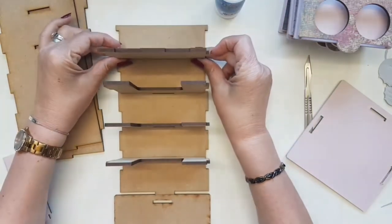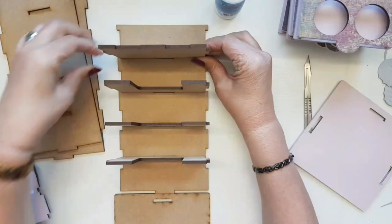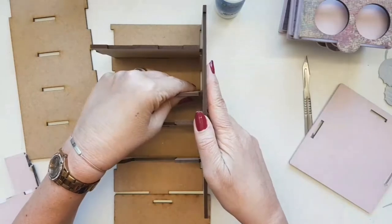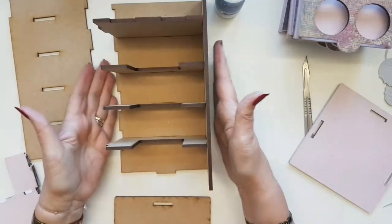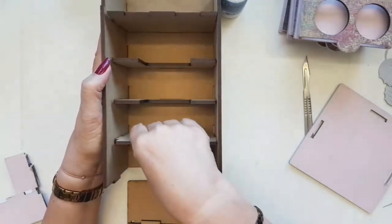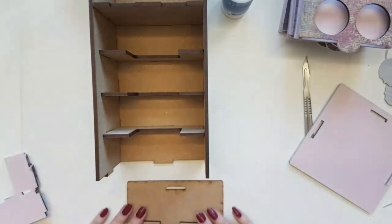Also put in place the base of the box unit that goes at the top of the storage unit — glue along the recess and glue into the back of the unit, and that will be secure. Then you can add your sides: they slot on like so. The first side is a little bit fiddly until you've got everything lined up perfectly, but then it just pushes into place. The other side will be easier because the unit now has more stability. I would glue all that together first and then put your base on.